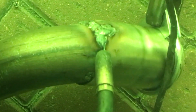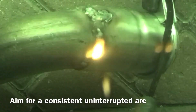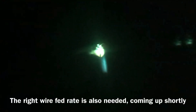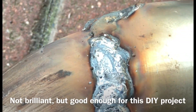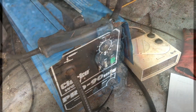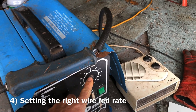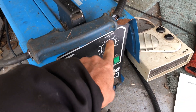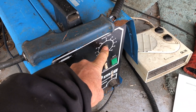Here you can see what it looks like with a reasonable gas flow. Try to keep a consistent arc — you can move the wand slightly from side to side as you're welding but not too much to break the arc. Also helps going downhill. The weld there has melted into the metal — not perfect but good enough. The other thing you need to set is the wire feed rate. If you don't have enough wire flow, the wire will melt and pull back from the weld.